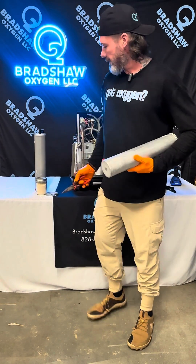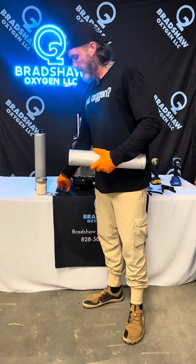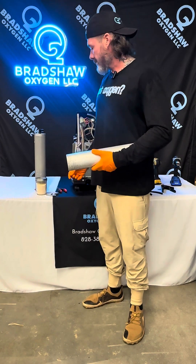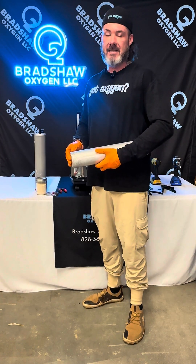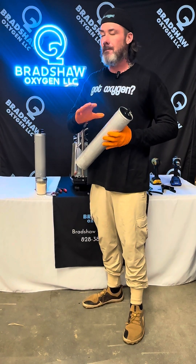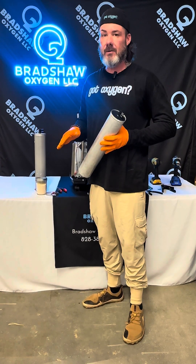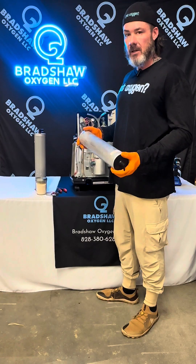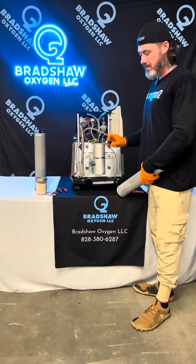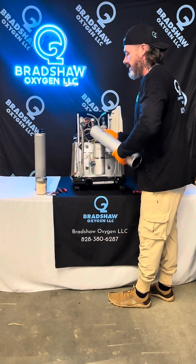Next, remove that little red plug. Another thing I've noticed is a lot of the larger repair centers — the giants of the industry — have been using cooked sieve. What that means is they take the material, dump it out, and basically bake out the moisture in the sieve material, then put it back in. Here at Bradshaw Oxygen, we don't do that. We use brand new material. Whenever you take these plugs off, you want to get these things on as quickly as you can. I do use an oxygen-safe thread tape, and the same way you took them off, you're going to screw these things back on by simply spinning them around like this.